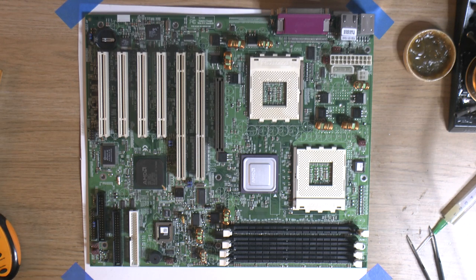There's a lot of copper in this board on both sides and in the middle, so just a soldering iron won't work. So some form of hot air or a board heater is more or less required if you want to do a board like this, or this board.